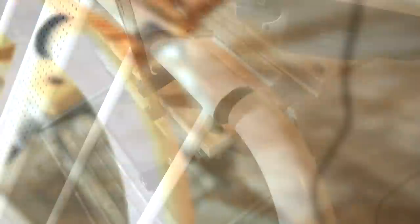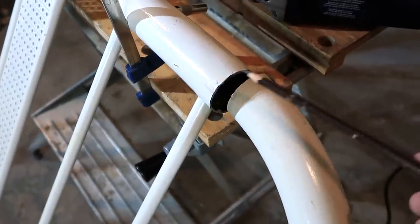So not quite as dramatic a difference, but still impressive — because it's tricky trying to gouge all the way around the pipe. It's confirmed: the slow gouging cut really does make the discs last about 10 times longer than a fast plunge cut.